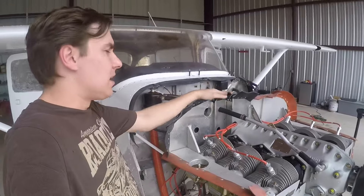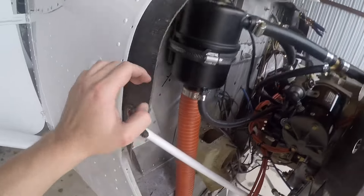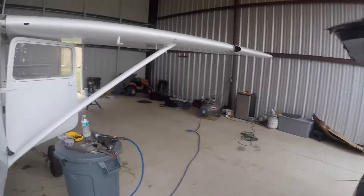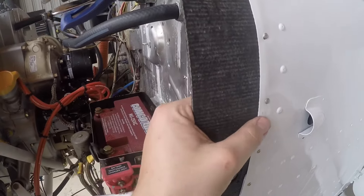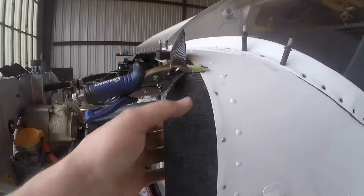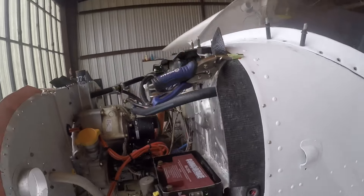I got this piece of baffle done, all the rivets pulled in nicely, and moved on to the next one. I had to cut these — I haven't been running the camera because the air compressor is very loud. I've already started to shoot down some of these rivets. There's a little retaining strip back here that they actually go into, and you smash it down.